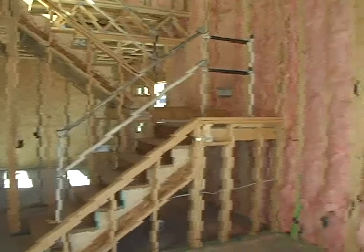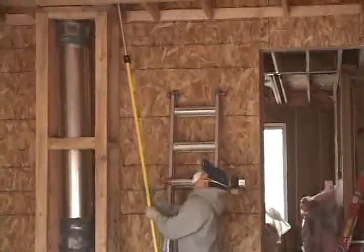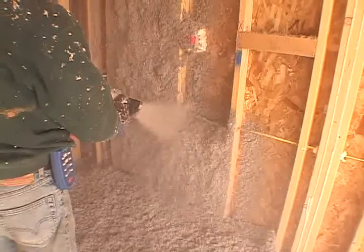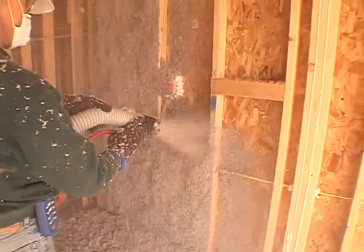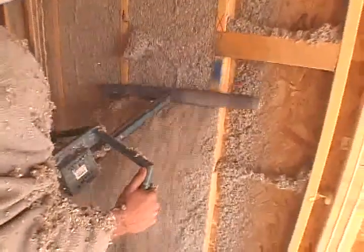floors, and ceilings. The insulation is installed after passing the frame inspection. Insulation bats are used in ceilings at shallow areas where blown-in materials may not reach. Blown-in R23 wall insulation fills gaps and voids in the wall cavity to create a thermal barrier from the outside air and also reduces sound transmission from room to room.